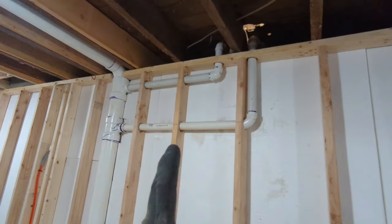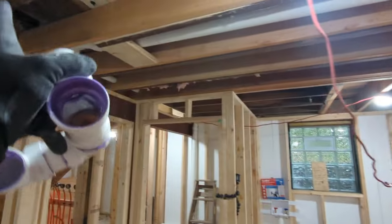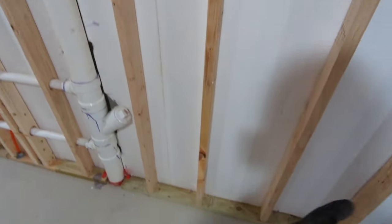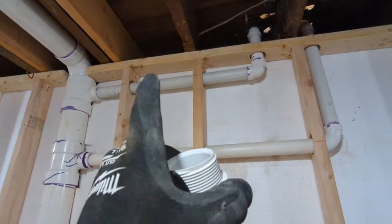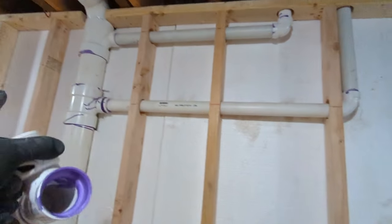So I got the kitchen sink vented, which is to say the fluids come down and fall down the stack, which has got atmospheric pressure on it because it's just open up out through the roof. Even the rainwater that falls in that little area of the open end of your stack is all the time washing down and away a little bit. So you also have to pull atmospheric pressure off to follow that fluid down.